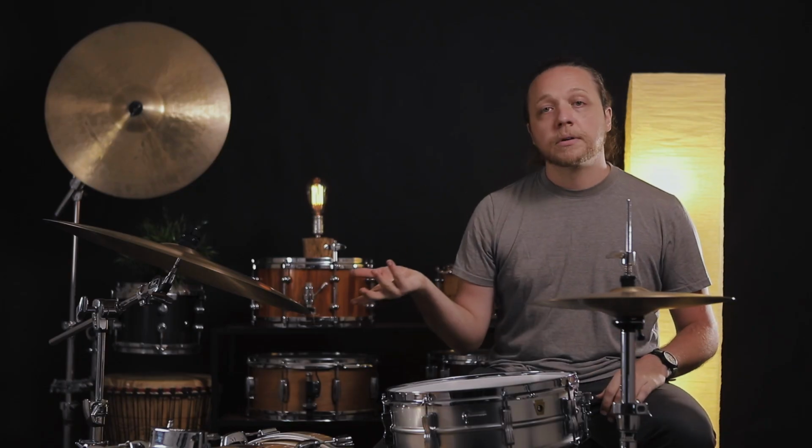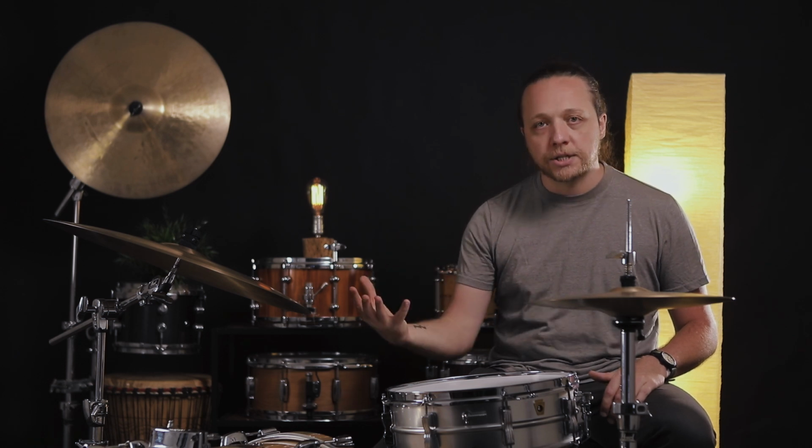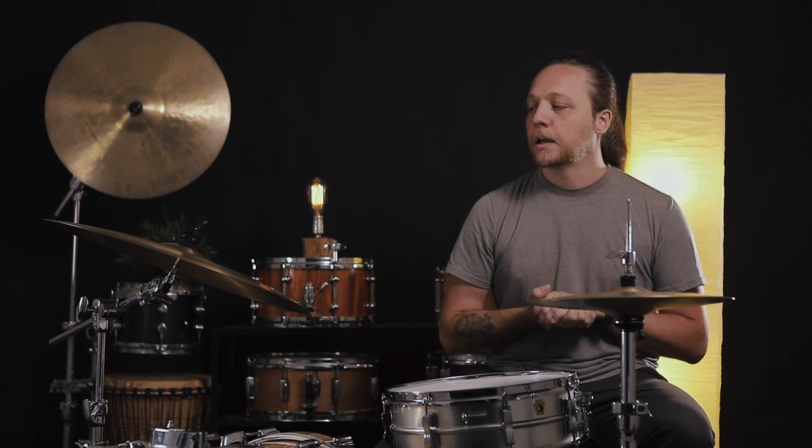Now, this cymbal that we use in-house almost all the time is hammered. It was pressed into shape in the first place as basically a blank, a Sabian AA raw ride, which is the shape of a cymbal with the bell in it and everything, but no hammering, no lathing. This has been hammered extensively, but not a lot of small hammering. It's mostly large hammering. You can't really see that it's had a lot of impact on it. It doesn't have that kind of cratery shape to it.